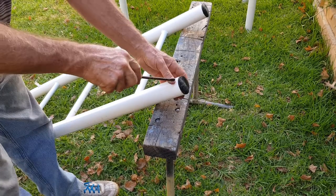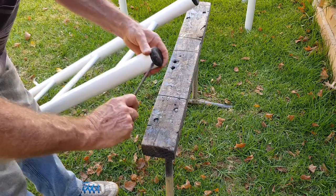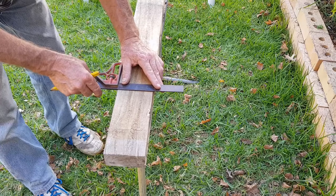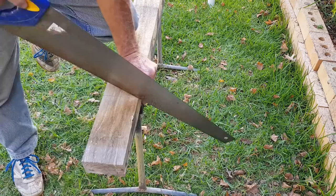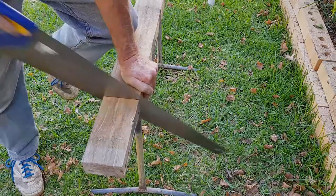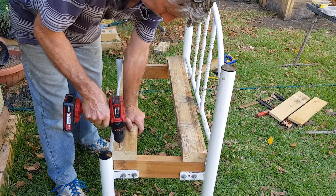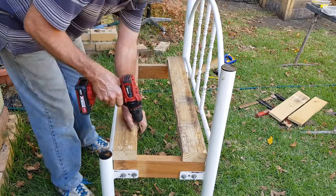I'll lever these plastic buttons off the ladder section — they'll come out pretty easily and that'll give the whole project a nice finished look. Now the rails that form the base of our seat — I'll mark them off and cut them. The ends of some of these pallet timbers aren't always square and sometimes they're a bit split at the end, so I like to get a nice neat cut. I always pre-drill these because the cheaper timber can split quite easily, and pallets are made out of fairly cheap timber — but if it's assembled well it's nice and strong.